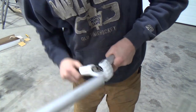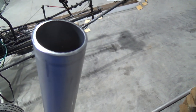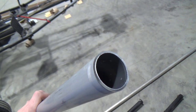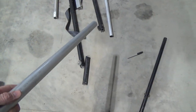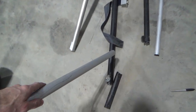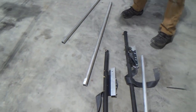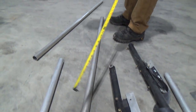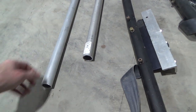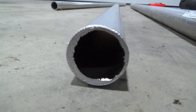This is basically how you cut. Look at that - would you look at that. It's a nice clean edge. We just have to file the inside a little bit and she's perfect. So this is the inside of that - it's doubled. We're going to slide this into there and then measure that four feet. I think it is four feet already. So we just slide that in and drill some holes, measure four holes. This isn't going to be too hard. We've got to clean up the edges because they're kind of burred. Good times.